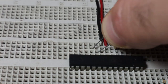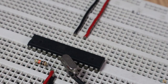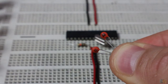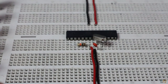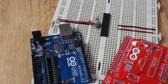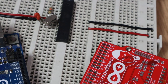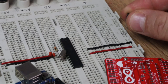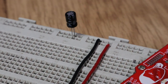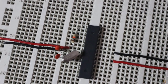The ATmega chip needs a clock input. This controller works at 16MHz, so a 16MHz crystal is added between pins 9 and 10. Since this is not a resonator, it needs 2 extra capacitors of 22pF to oscillate — make sure they are 22pF, otherwise the signal won't be 16MHz. The main 5V input must have no voltage peaks, so a large capacitor is placed at the input plus some smaller decoupling capacitors around the VCC pins. Remember to connect ground and the microcontroller should work.